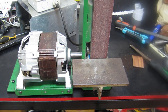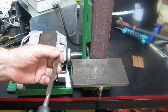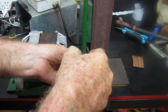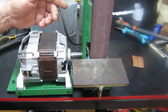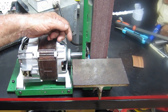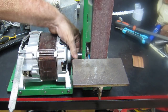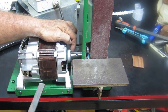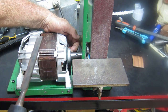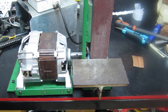What I did was a little bit bush mechanic-y. I marked the adapter on the motor shaft with some blue felt pen, then got in there with this wood chisel and very, very slightly touched it to see what got removed and where. Luckily it was on the opposite side of where I had the flat ground for the grub screw. So I very carefully machined a little bit off it bit by bit, kept trying it until I got to the point where I could clamp it on the flat with a grub screw and it pulled it straight. I think I'll get away with that because I've machined it to fit nicely up onto that larger part. Runs nice and true now, so I'm happy.